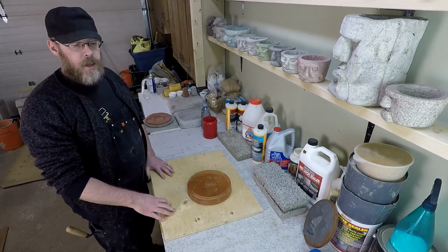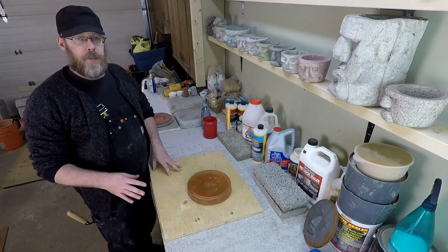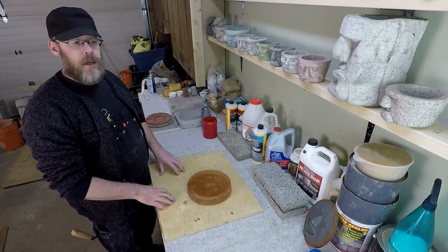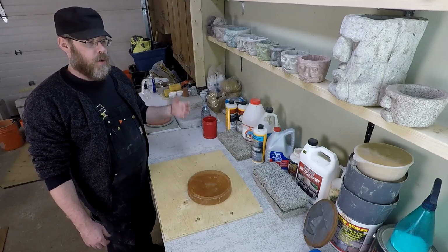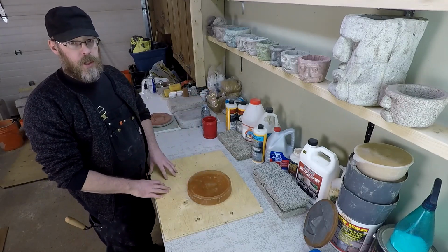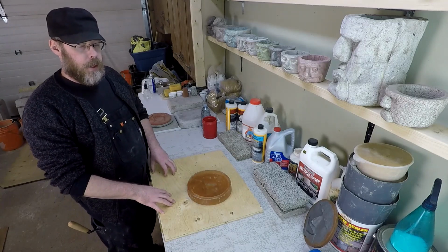And when it comes to the coloration, I always warn people, look, I could deliver something like black concrete or charcoal or dark gray, but it's not going to be specific. If you're very particular with the color that you want, it must be this exact shade of gray or of black, forget about it. It's not going to happen because the mineral content of the water or the amount of humidity on the day that you do this coloration or how old the concrete is, meaning is it fully cured or is this concrete green, or is this much older, you will have a lot of problems if you are trying to get an exact coloration for your concrete. That's pretty hard to do.